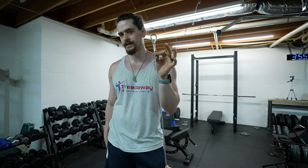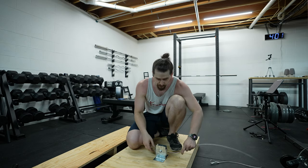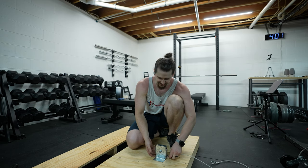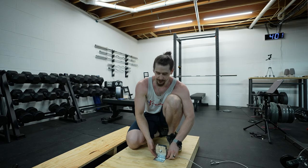That is one side complete. I would advise trimming this side of it down, maybe putting a little bit of tape of some kind on there. That way this isn't just ruining your clothes. An important step that you want to keep in mind is if you're using a pulley that doesn't have a cotter pin or some other way of separating, you'll want to loop your cable through the pulley before terminating the other side, or else you're gonna have to prepare another section of cable, because you won't be able to actually loop it through the pulley.